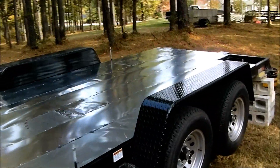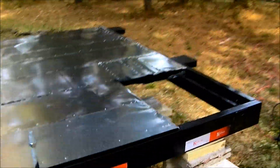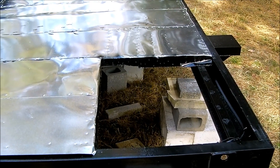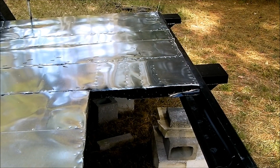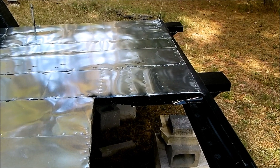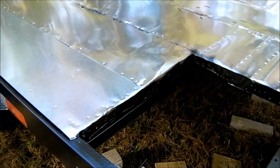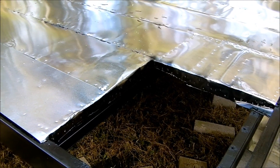Here's a quick view — this is the opening for the deck so that water can pass right through if it does get in at all. I even extended the flashing down over the edges of the wood so it couldn't get into the seam. I also sprayed pre-paint and sealed the edges of the cut wood to prevent any capillary action of water wicking in, even though it is treated lumber.